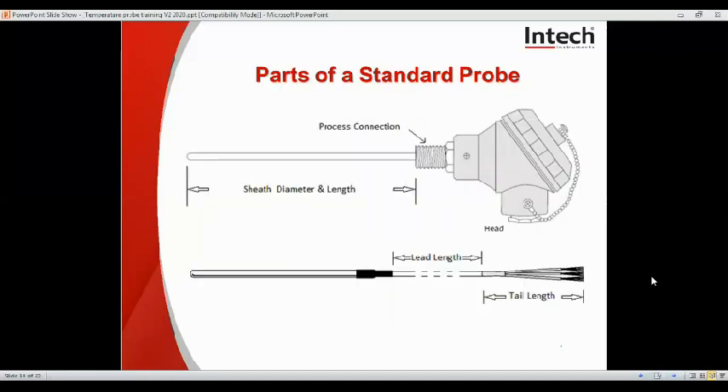Here we introduce some of the different form factors that temperature probes can come in, and the important things to specify when wanting a probe. The most common types are a probe with a head, process connection thread, and a stem, and below is a probe with a stem and lead. Most important to specify is the stem diameter and length, and the lead length if needed. Other factors include pot seals between the lead and stem to allow for better seal against moisture ingress, or the ability to have smaller stems — with thermocouples we can potentially go down to one millimetre stems. We can also add threads part way down the stem or running nuts, Tri-Clover or RJT with a castellated nut, typically used in dairy applications with a highly polished finish for hygiene.